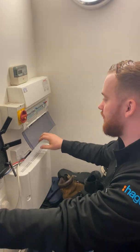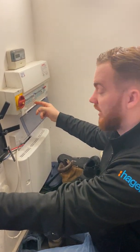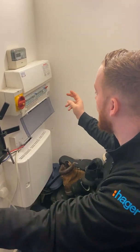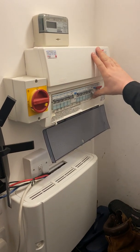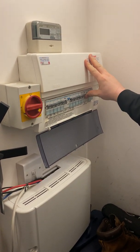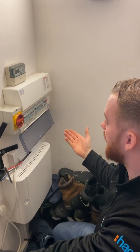A typical layout would be a dual RCD setup, so you'll have two RCDs — these are the most likely things to trip out. A way to reset the power would be to just try and turn the RCD back on. If it trips out again, that means you've got an issue in your circuit.